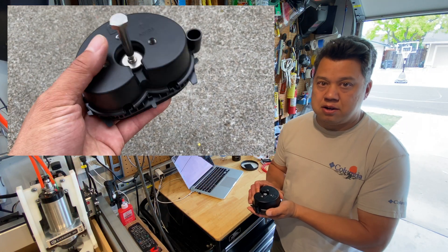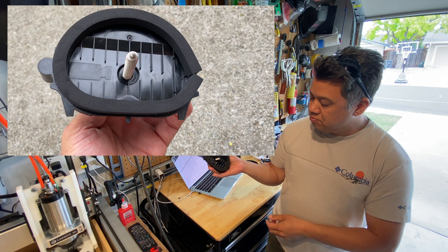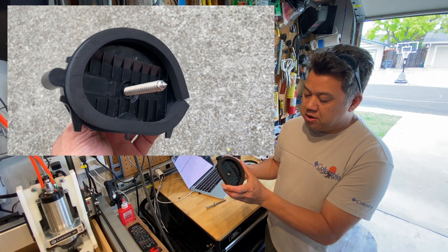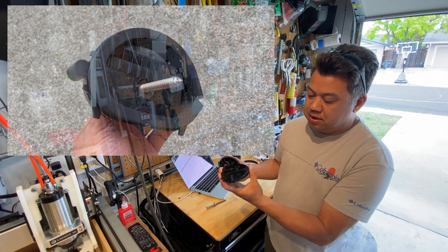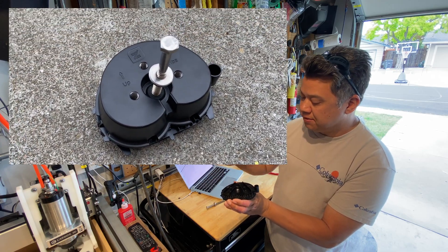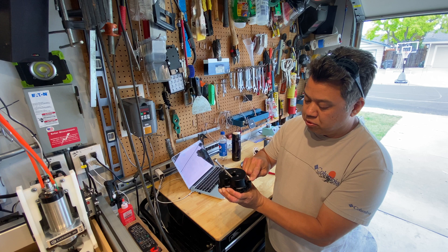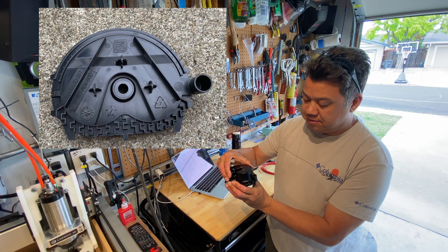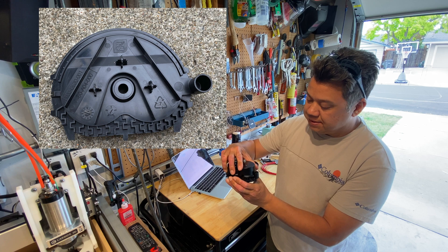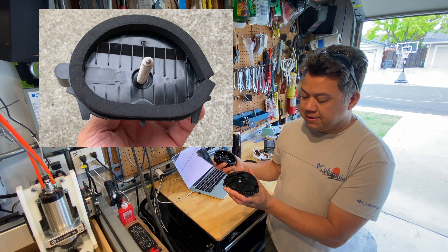The new system no longer requires a long piece of unistrut. Each individual mount gets installed on the roof — it's two pieces. The bottom is a piece of plastic with a foam gasket installed on the roof surface, and the aluminum mount on top has tapped holes for mounting the panels. That creates a sandwich: the bolt goes through, and there's a little port for injecting sealant. As they inject the sealant, it fills the entire cavity and starts to leak out through a labyrinth seal, which tells them the whole inside volume is full of adhesive.